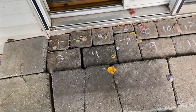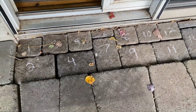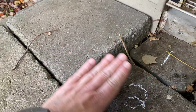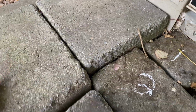All right. The easiest way that I found, you just take out a piece of chalk, label all your parts, and then you can rip them all out and stack them to the side, and you can work on it. But as you can see, this corner is low, this is not as low, but it's still low. This is where everything should be, and coming off level off that, it's not. Even these are a little unlevel, but at least they're pitched out, so I'm not really worried about those.